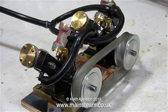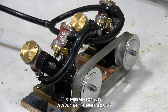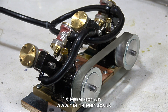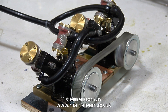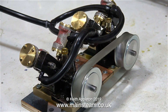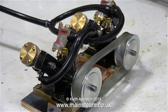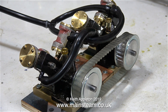I'll do that in the next episode, and I also need to start thinking about the piping layout. I'm waiting for two reversing valves to arrive — it's quicker than making them. Someone may ask why I need two reversing valves if the engines are ganged together; well, someone buying the engine may need to split it for a twin-prop boat, and having directional and speed control individually on both engines could be very useful for rapid manoeuvrability. And that's it for this episode — thanks for watching and I hope you found it useful.